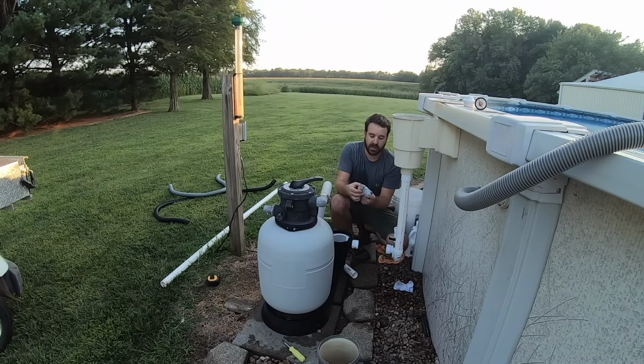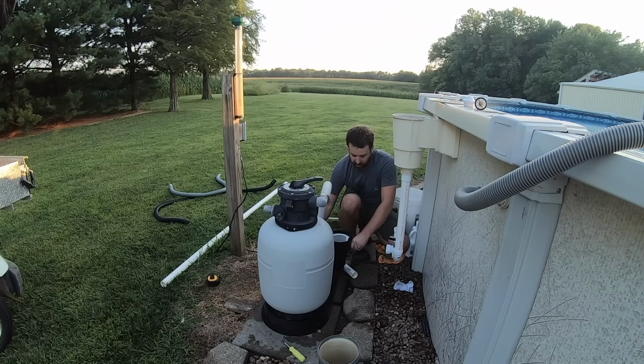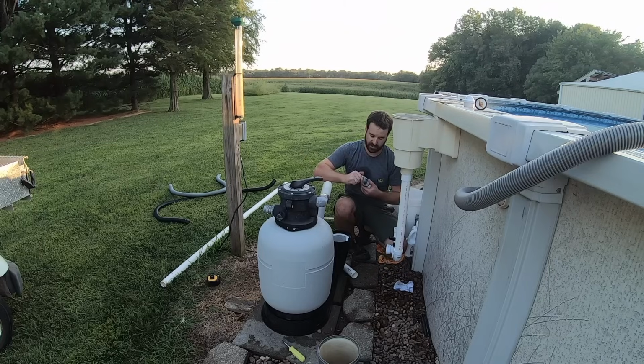And you'll see I use something called Blue Monster PTFE pipe thread sealant. You know, I used to always use the tape that you had to wrap around here the correct direction, otherwise it would come off as you screwed it in. But I've since switched to using this sealant here. So much easier. It's got a little paintbrush on it.